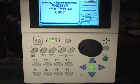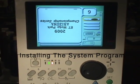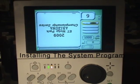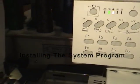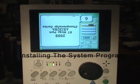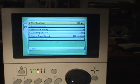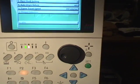This video is going to demonstrate how to install the system program for the firmware for the M controller style Tajima machine. This particular model is a TEMX C1501 single head. Before we begin, we want to check some of the parameter settings, namely the ATH, which is F2.